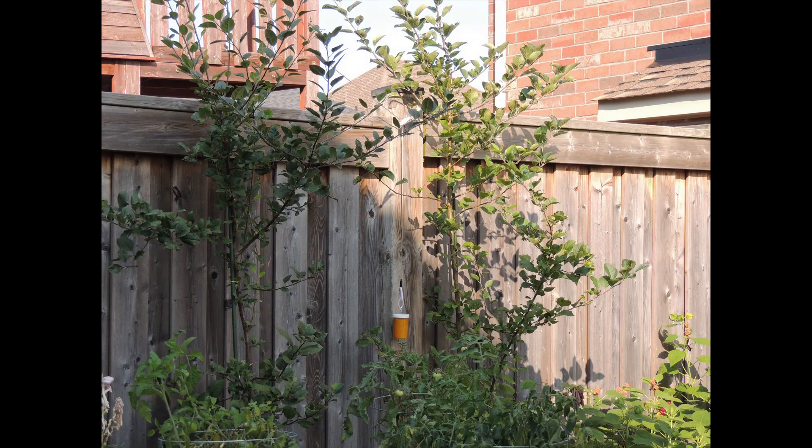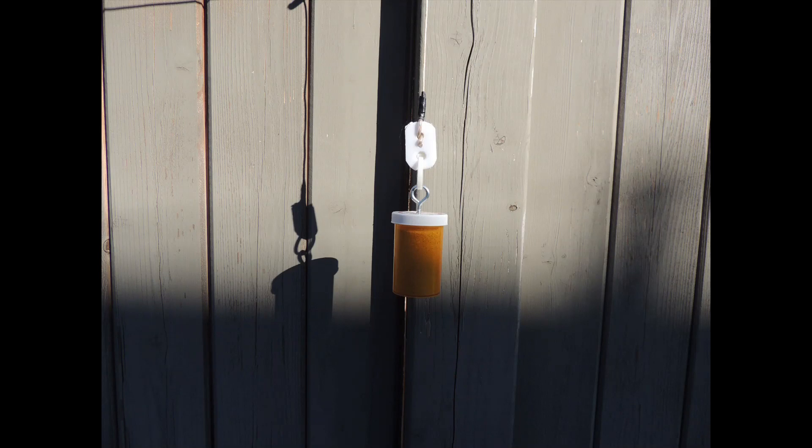We are now at the end of the antenna wire. It is routed to a carabiner and an insulator. At the end of this wire, I added a counterweight to prevent sagging. This is a close-up shot of the counterweight — what it is made of and how it was attached to the antenna wire. You can also see another DIY insulator here made out of plastic cutting board.